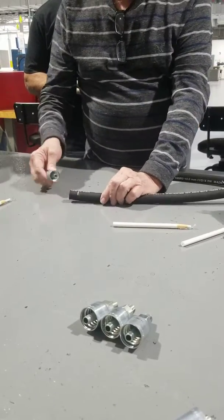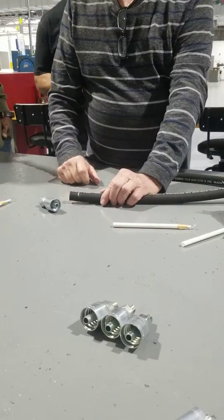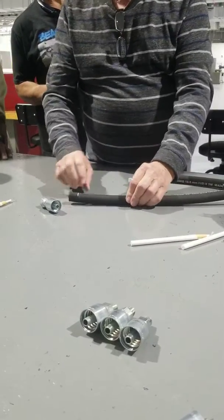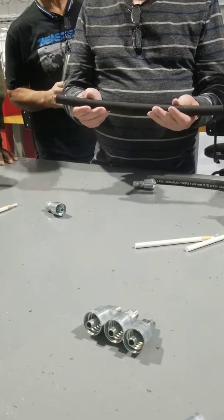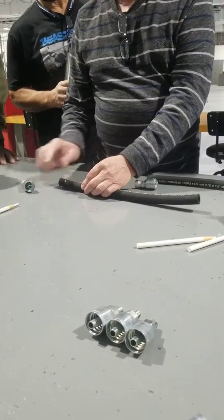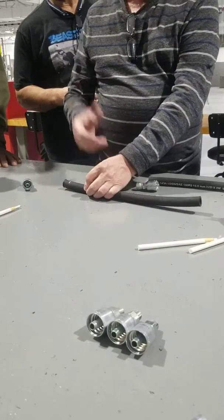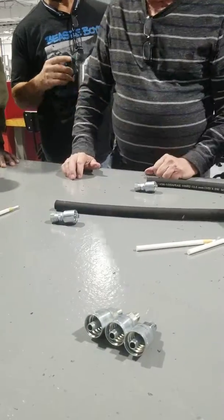I'm not saying that I haven't looked, but it's better to put a line on it for your own. I've got some pencils here. I would rather see every one of you, when you make the hose, have a line with respect to where that fitting goes on, and then you can see it. I usually put it a little bit past, so when we crimp it, you can actually see it and you know it hasn't come out. There's no question.